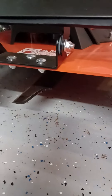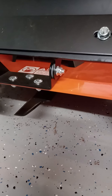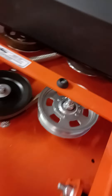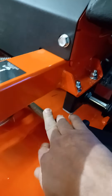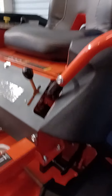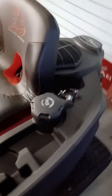There's a lifetime deck warranty. The blades are very tough Bad Boy blades — you can also get mulching blades. The leading edge of the Bad Boy has a hardened edge. The belt on the deck is a 5/8-inch Kevlar-corded belt with six cords of Kevlar inside and two cords of Kevlar on the outside covering.